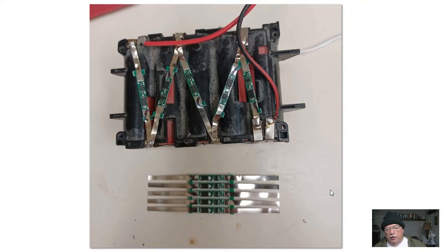Here's my lithium-ion cell where I actually soldered these small circuits across it. Once this is done with these little circuits, I don't need any of the circuits I used before — I can just connect the voltage source through a constant current source to reduce the current directly to it, and it will charge up. This was tested and charged up to right at 21 volts, which is what it should have been.